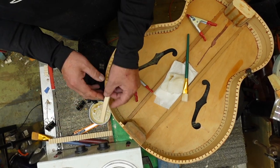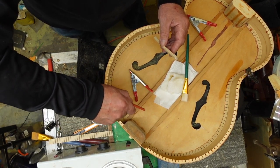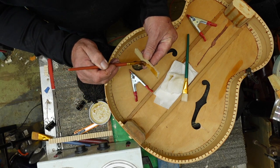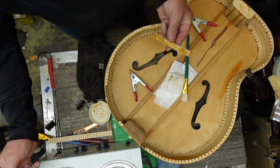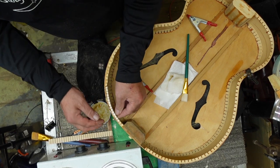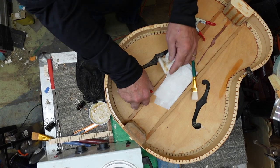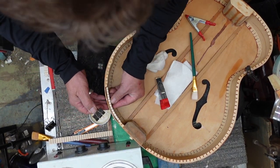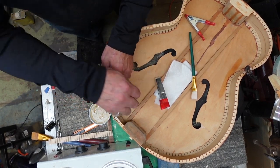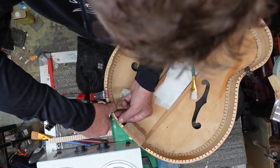Over here we got a pretty good size piece. So we will paint glue on thick both sides, back of the kerfing, and here we go. Get a little bit of that squeeze out off of there, and we will put these office binder clamps, they work really well. We'll put one of those in the middle, and we'll make sure everything is level here. We'll put one of those there, loosen this up just a tad like so.